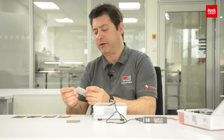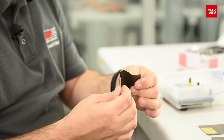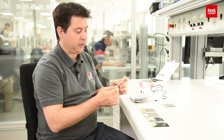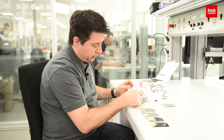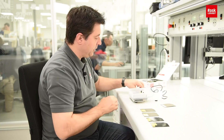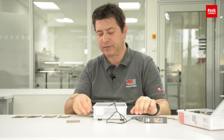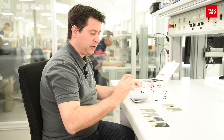Then the next try: I will use a flexible ferrite absorber sheet, which is 0.1 mm thickness. I will put this 0.1 mm thickness between the coil and the aluminium. Still not working, so I have to increase the thickness.